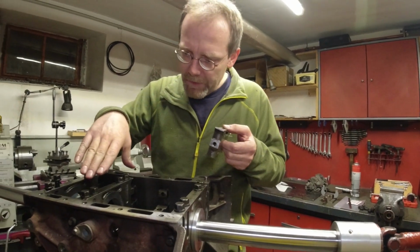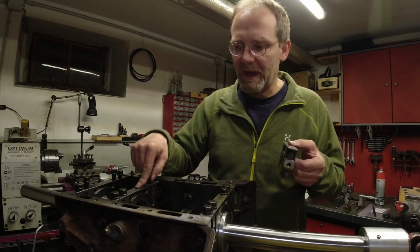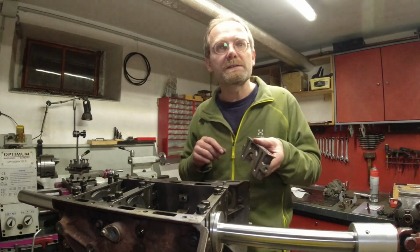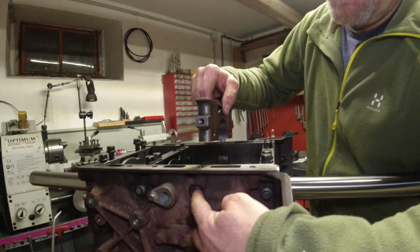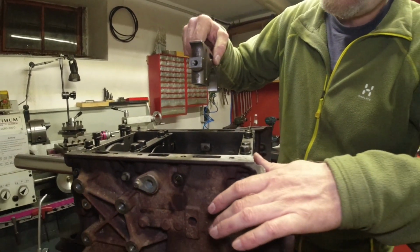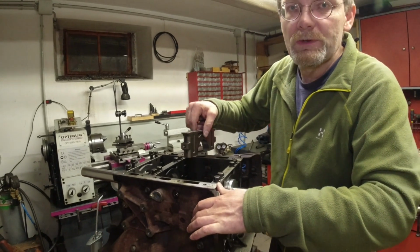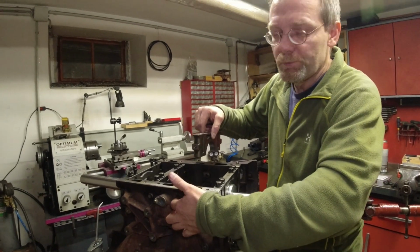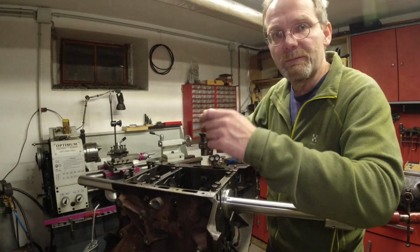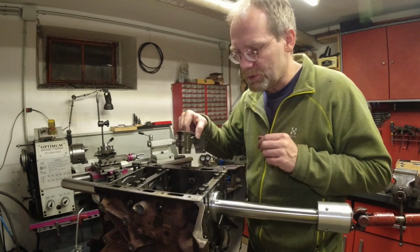I did the same thing on the other one as well, except here I only had to take off 0.5 millimeters. Okay, so I did only as much as necessary. Why? Because the old machinist told me. The side bore here had enough clearance for this thing to sink down another 0.65. I think if I would have went 0.7, the bolt would have started to hit, because the bolt has only like 0.5 millimeter of a slot around it, so the hole is 1 millimeter larger, maybe 1.2.